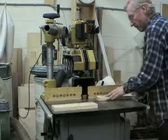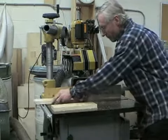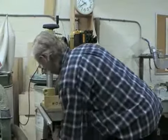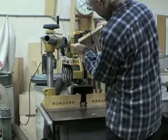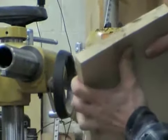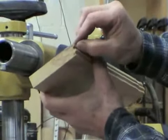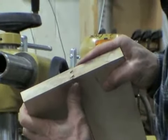Here's the second piece. We've got a nice joint — it's probably within a few thousandths of an inch of being flush on top and bottom, well within the sanding range of joinery. And the profile is well centered — you have about an even amount of distance on top and bottom of the cut. So it worked out pretty close.